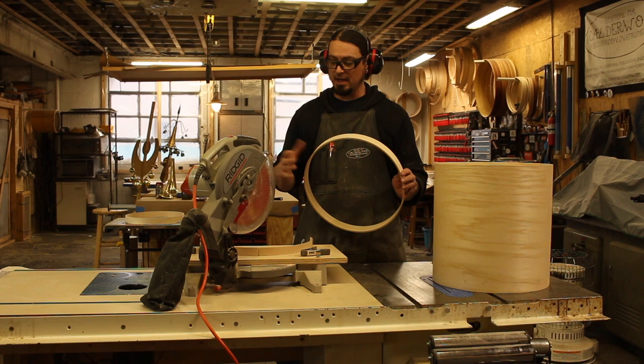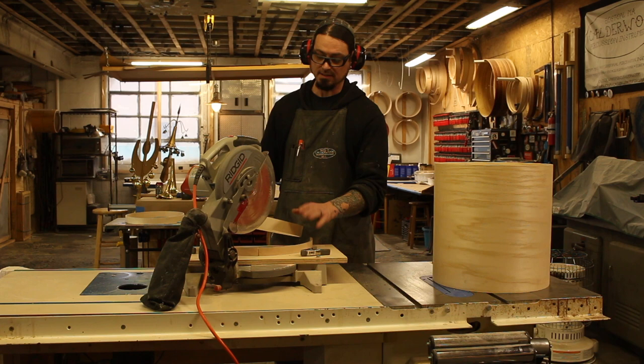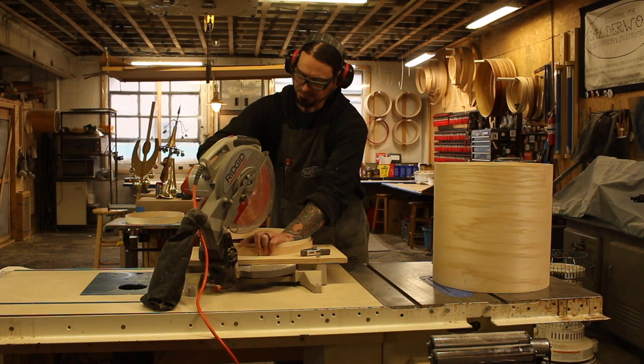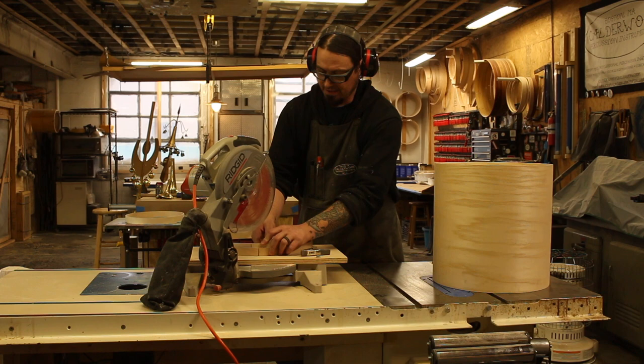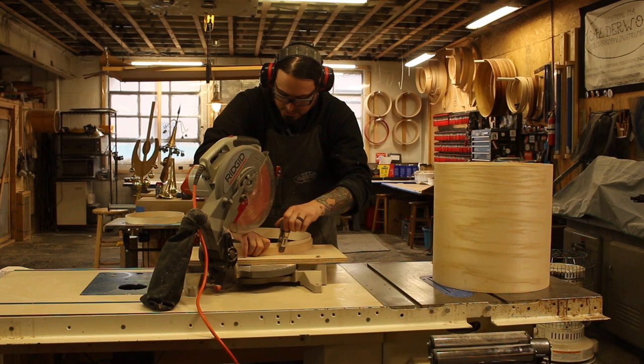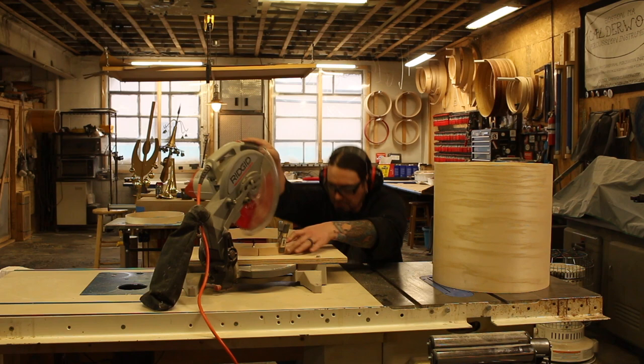It gives me a reference point of a place to start. So now what I'm going to do is put it back against this round fence and use that to maintain the angle of the cut so that the scarf joint stays straight and at a consistent angle. The side that I'm not cutting I'm just going to clamp against the fence so it's out of the way and there's no risk of that accidentally being anywhere near the blade. And then the part that I am going to cut, I'm going to much more carefully line up, about there. Then I'm going to put the spring clamp to keep that in the right spot.